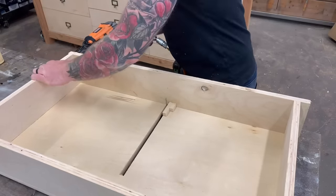With your box entirely hooked together, run the entire thing back through the table saw, cutting one continuous slot through the sled as well as recutting a dado through your front support piece. And with that, you are ready to cut some box joints. Take your stock piece, push it flush against that little peg, and run it through your saw. Then flop it over that peg and do it again, continuing this process down the line until you have cut all your notches to the end of your stock piece.